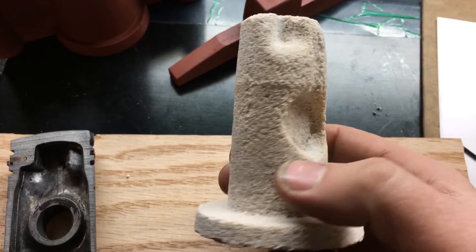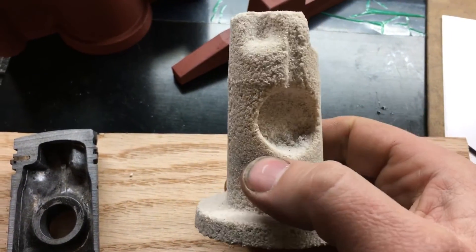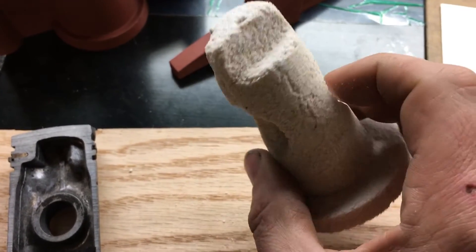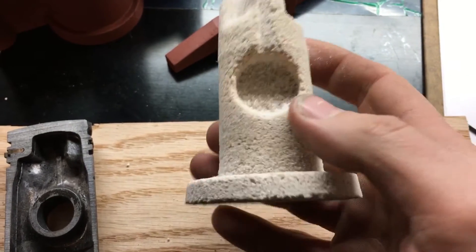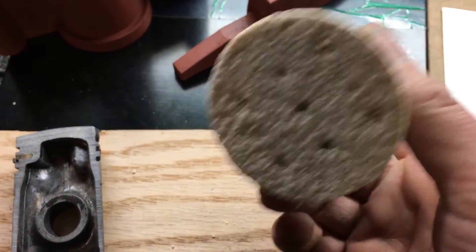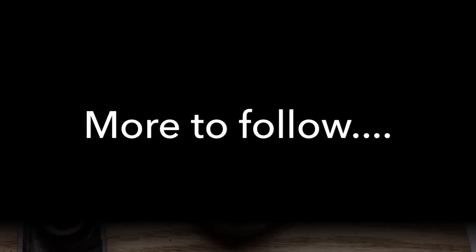This is the first one I ever did, so I play with this one. The others are back in CO2 curing until I'm ready to pour. You can see not a lot of detail. I learned that you want to pack it as little as possible, but make sure it's firmer on the edges. This is just play sand, so you're going to have a rough shape, and that's okay. The basic idea I'm trying to get here is proof of concept, and that's what I'm trying to do.